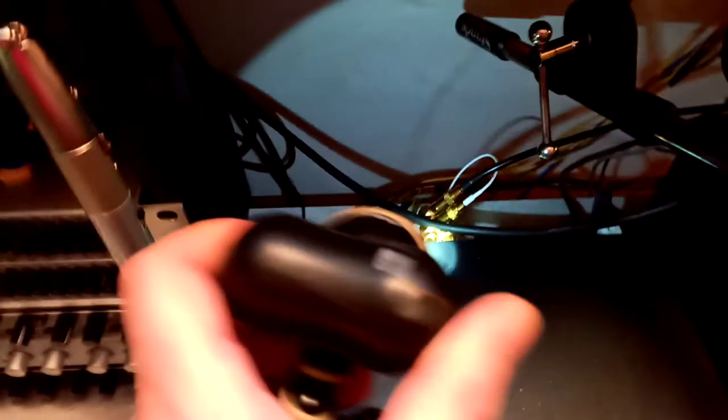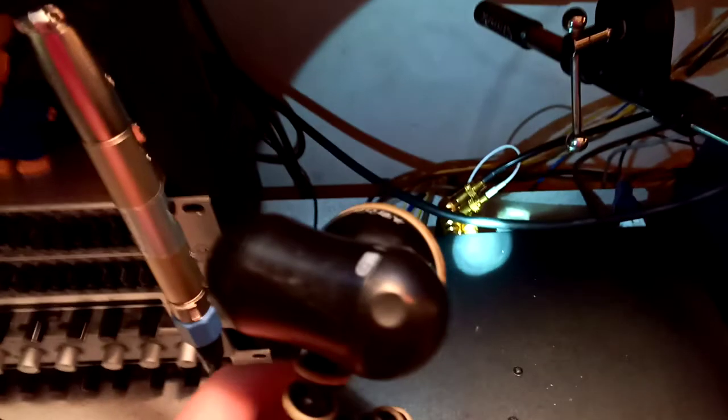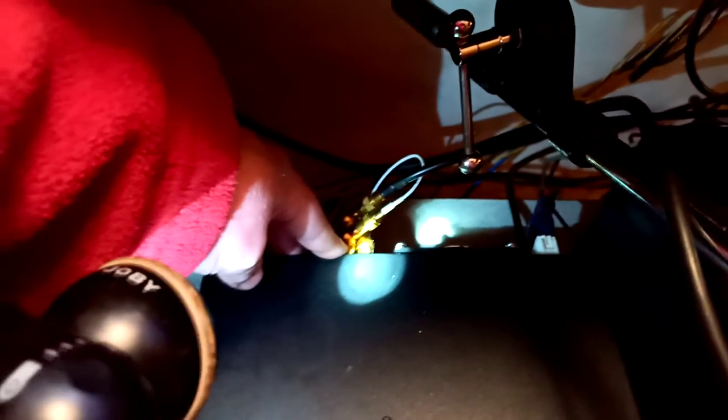It gives you access, it drops right into the back of the radio, into where the auto tuner cord went. You take the cord and you lay it inside the cover, and then this modification jumps right in, and there are instructions on how to do that online. So to get the IF out to the RSP Duo, you will need an RCA T or some form of a T.